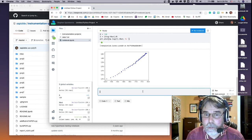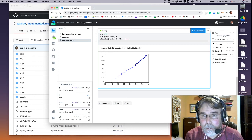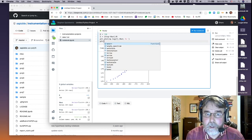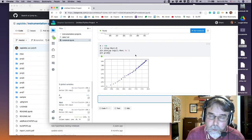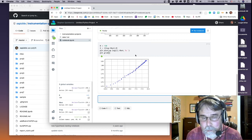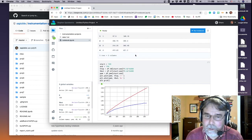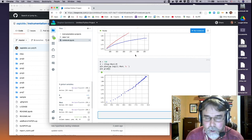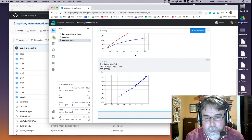We'll go back later and use a more sophisticated model to fix that problem, but for now just make your best estimate of the parameters A and I₀ based on the data you have. That means fitting this data as best you can with a linear model using polyfit: use the natural log of I for x and the diode voltage for y. That's the whole approach — take the log of the current and fit it versus voltage to a straight line. I hope that helps, talk to you soon.